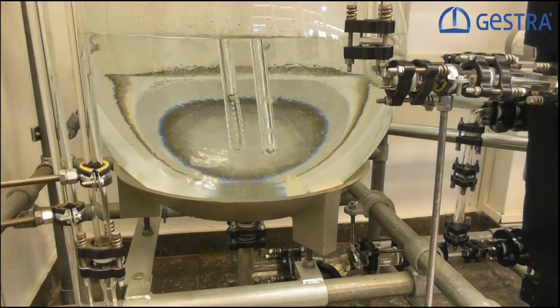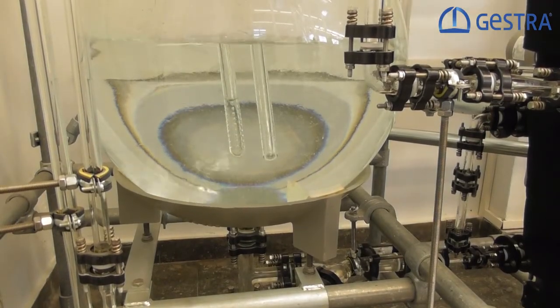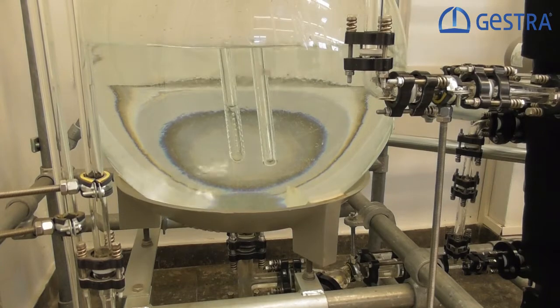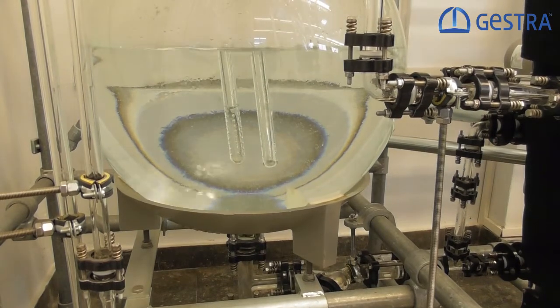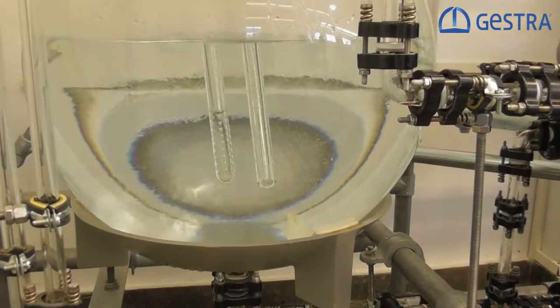Let's do it. We will start with the injection on the right. The injection pipe is designed with a 15 mm or 0.6 inch drilling. In the beginning, we see some air bubbles being injected, but the steam injection follows after a few seconds. Let's take a closer look and keep our ears open to the appearing water hammers.